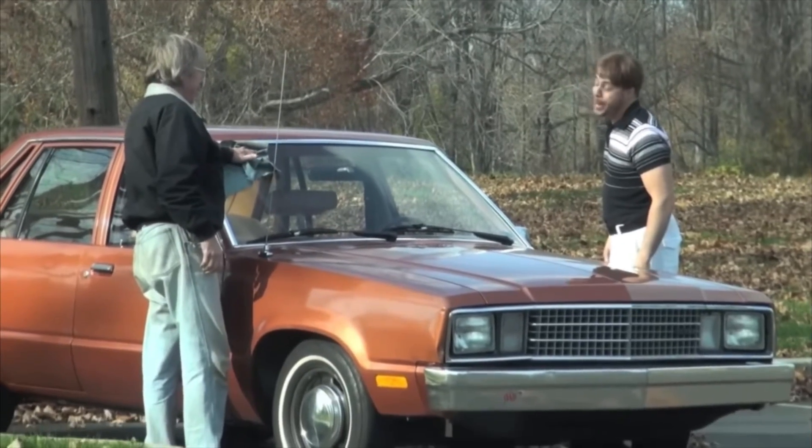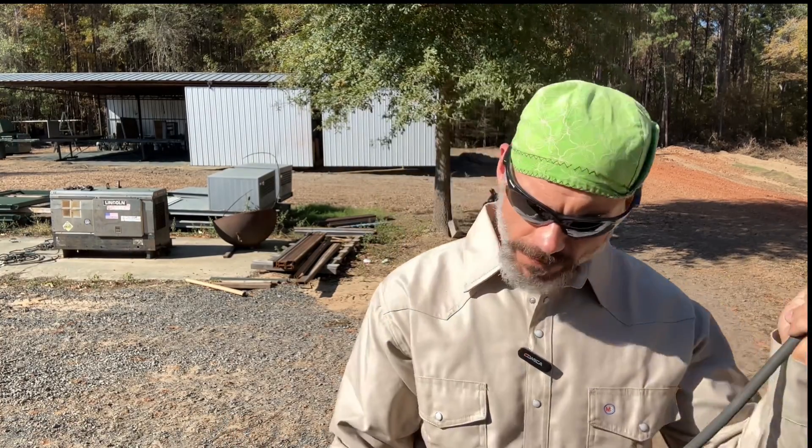This used to look nice and shiny - look at that, nice and shiny. Now it looks burnt and gnarly. This looked a whole lot worse before I started chopping it back. As you guys start welding, if you haven't already noticed, the ground would get so hot you couldn't touch it - it would boil water off of it. Immediately stop and try to figure out what it is, because it's just going to get worse. It's just going to keep getting your leads hot, and instead of cutting this much off, you're going to have to cut more off. You can cut it back to the good.